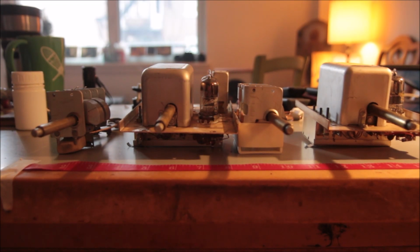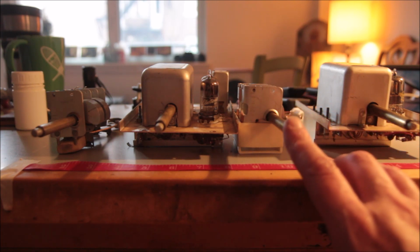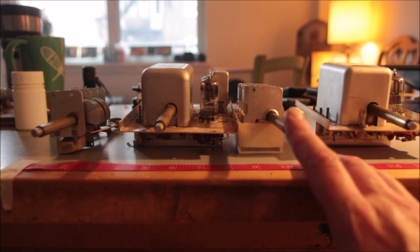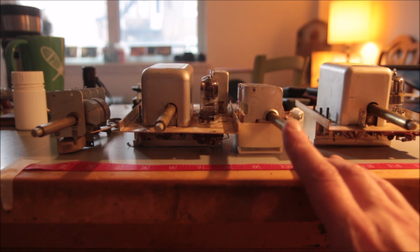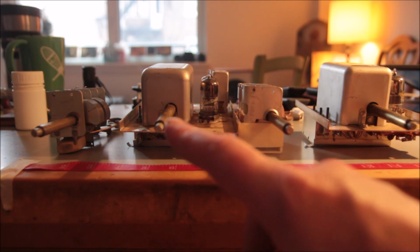What you're looking at here has the makings of a superior front end for frequency modulation. You've got two complete front ends, one and two, and you've got an intermediate tuning capacitive stage here and here. Now this is a fairly simple one. It's basically just connecting the various points of the two front ends together and capacitively coupling them. This one here, on the other hand, is a more involved one. It's as complex a tuning capacitor as is in here and here.